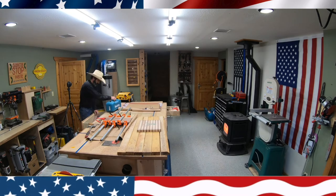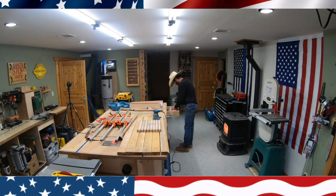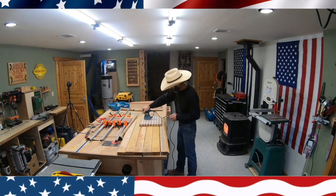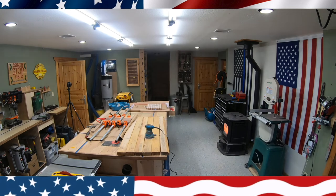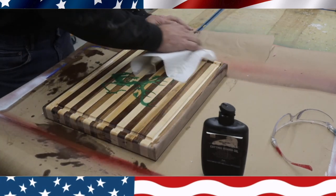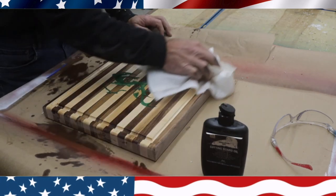I went ahead and put a little half-round around the whole thing to soften it up. I then get my Makita sander — I need to get dust collection for it — and sand it with 200 grit, then go to 600. Next up it was to get some walrus oil and coat the whole thing. Now it's really looking good, and there's a picture of it. Thanks very much for watching Outlaw Woodworking — I will see you next time.